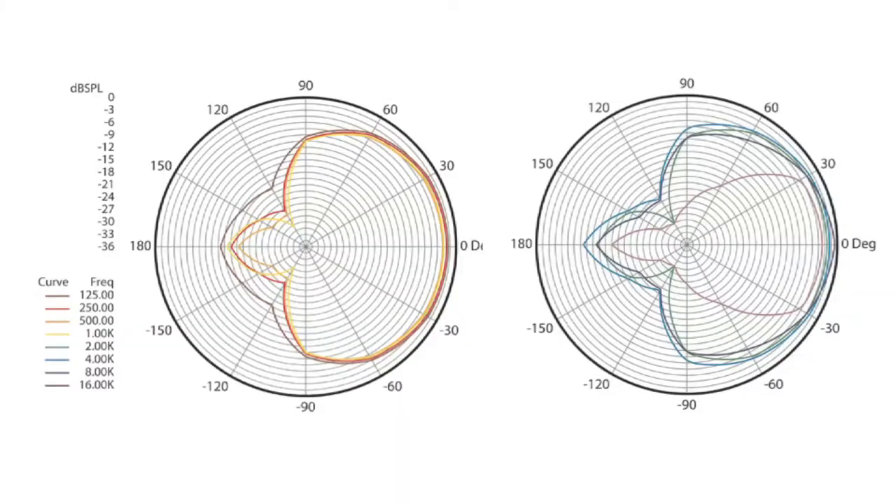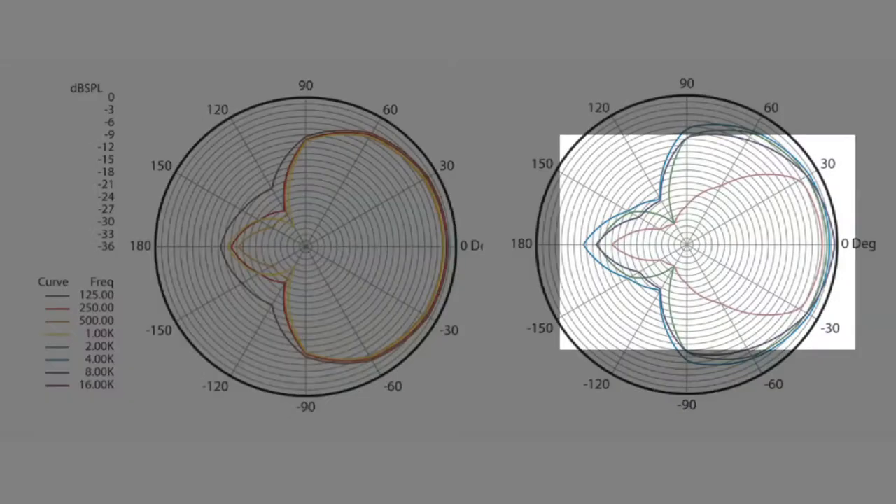The really cool thing about this mic is the polar pattern — it's very wide and very consistent in its response out to the edges, a long way up in the frequency spectrum. If you look at the graph, you only start to see a roll-off around 16 kilohertz. If your audience can hear that and your PA system can reproduce it, you're in an amazing — and slightly scary — place.